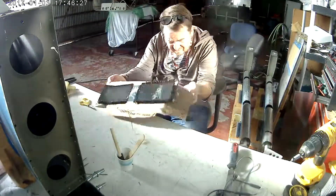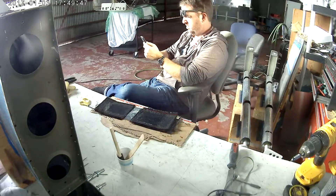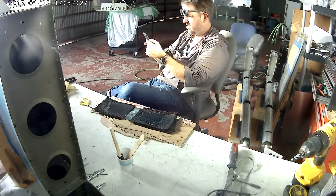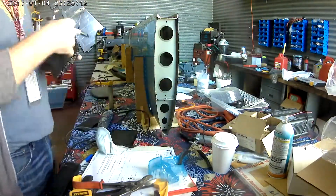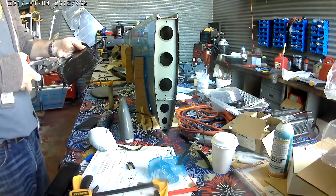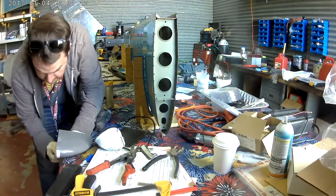One thing about carbon fiber — if you want to use it, that's great — the only problem with it is it is conductive. It conducts electricity very well, shockingly, for the material that it is. Any piece that basically touches aluminum, you will get galvanic corrosion there. It'll basically be a battery. You'll have two conductive surfaces where moisture or water could get in, and you're going to get corrosion. So what I did instead was made sure that after I put the layers in, I sanded it back so that there was no threat of it actually touching aluminum. And dabbled a little bit of extra epoxy on that end, just to make sure that if there is ever any contact, it's epoxy and not carbon fiber.